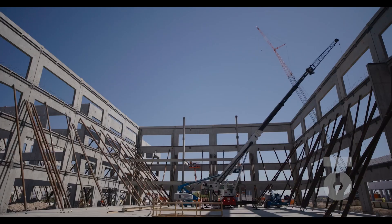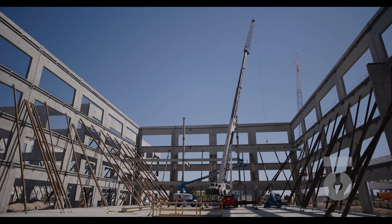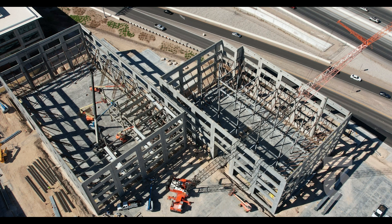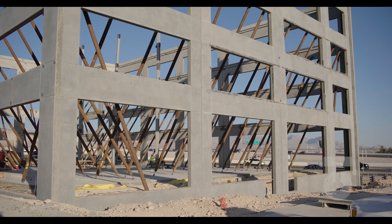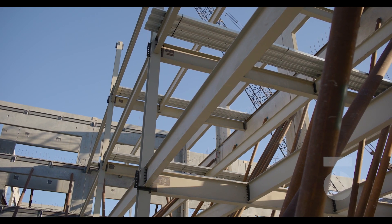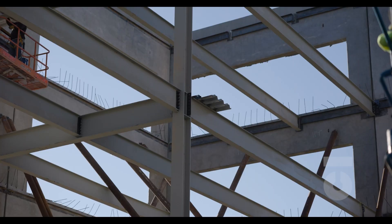Even the example of our office building — our office building is a tilt-up steel structure, meaning it has concrete tilt-up panel walls at its perimeter and steel columns throughout the center. The panel walls span four stories and are lifted and set by the concrete contractor, who also needs to set them to plumb. Since our concrete panel walls are plumb, we already have a guide for our steel as we erect. Having four plumb walls around our steel almost contains and keeps our steel plumb. However, that is not a hall pass to not plumb your structure — you still need to plumb your columns and structure in general.